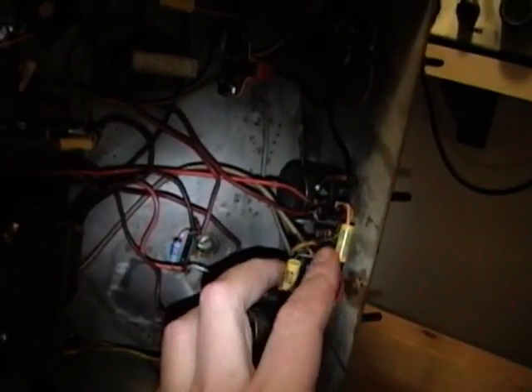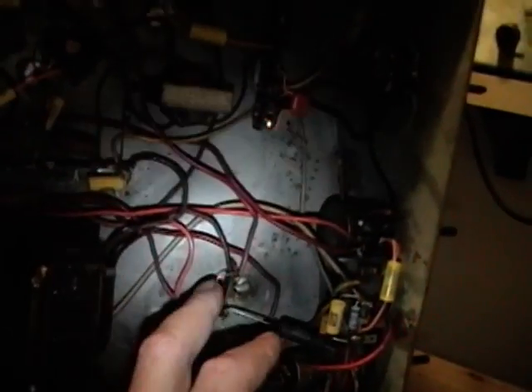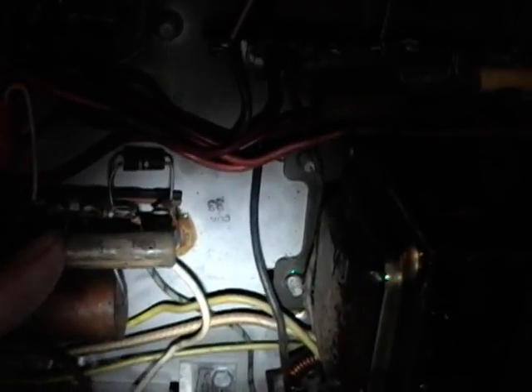You can see here's all the new capacitors in yellow and new resistors in blue, and I still have a few left to do over on this side. For example right here, I've got a 0.005 microfarad at 600 volt, and I've already pulled out a replacement.